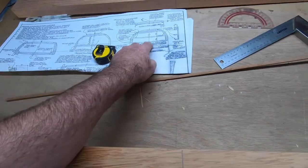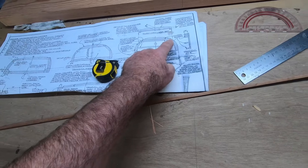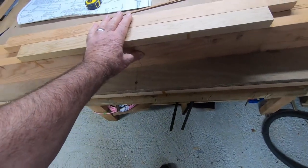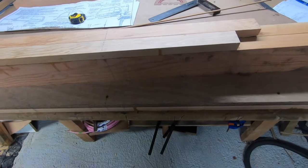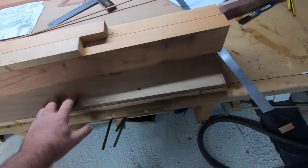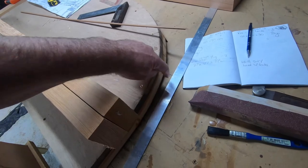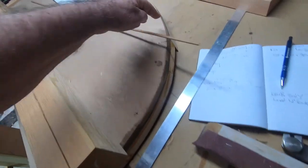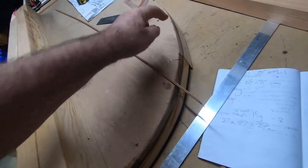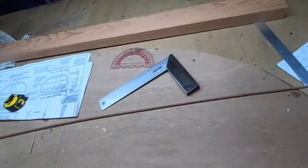I need to make sure I've got a consistent curve because I've got five or six pieces of wood like this, and then these pieces will be cut off at the corners — hence they are a bit thicker at the edges. There's a lot of wastage of wood which I can't really avoid. I can only attach them with screws at the moment because when I come to fit the longitudinals, they've got to be cut through this piece of wood and the transom itself.